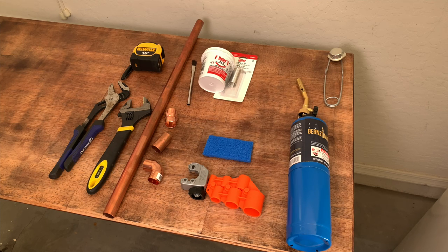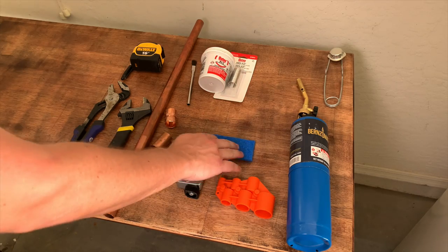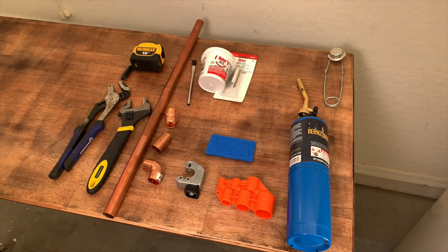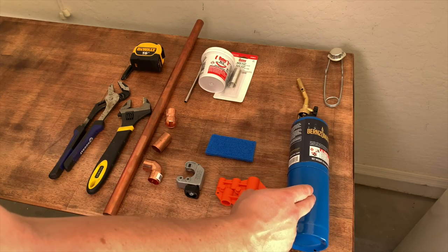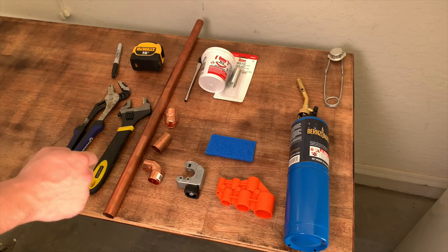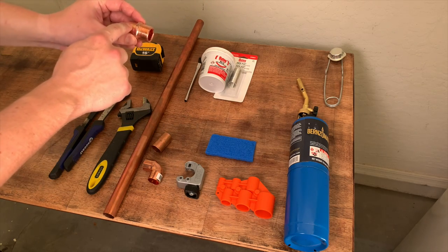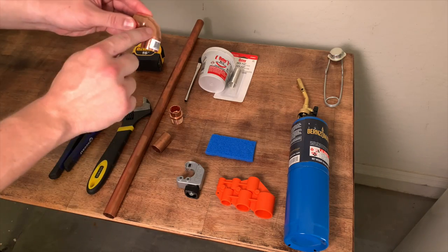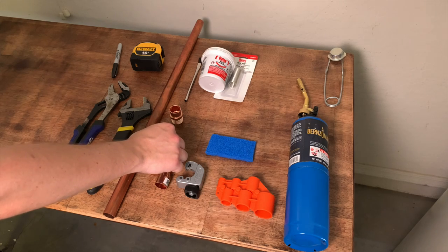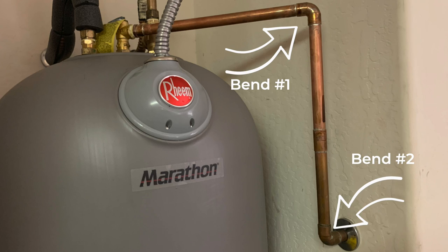Let's go over the equipment needed to solder copper pipe. You need a pipe cutter to get things to the proper length, a deburring tool, and an emery cloth or abrasive pad to smooth and sand down the copper near where the connections are going to be made. You need a propane torch to heat the copper pipes, flux and solder, and a brush to wipe the flux on. I also have a measuring tape and a Sharpie to mark the correct cut points. In my case I have three fittings: one male pipe thread to copper that screws directly into the water heater, one to make the first turn, and one for the last connection. Most city code allows a maximum of three or four bends in your pipe leading away from the TPR valve — I'm going to have two.